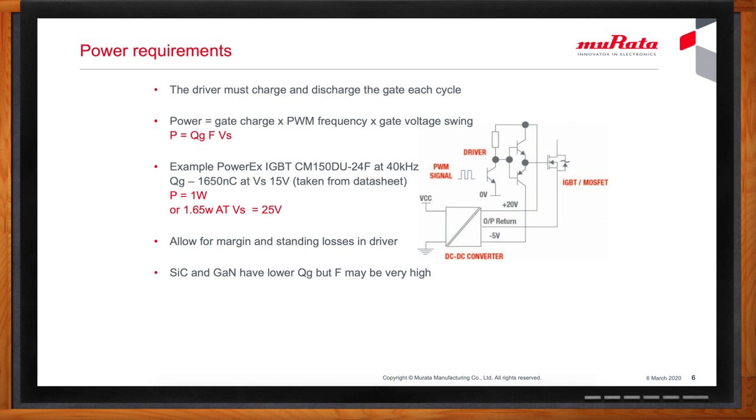It is not unusual to calculate that several watts of power are needed. Power is dissipated in three ways: in the internal gate resistance of the device, in any external resistance introduced, and in the driver transistors. MOSFETs generally have lower gate drive charge than IGBTs, so the calculated power can be much lower. However, MOSFETs can run at a much higher frequency than IGBTs, so we do see MOSFET applications at high frequencies where many watts are still needed — power needed is proportional to frequency.